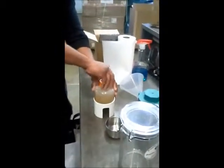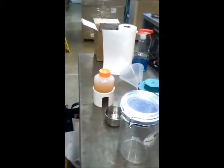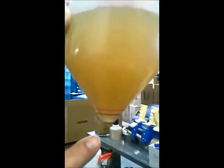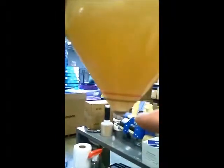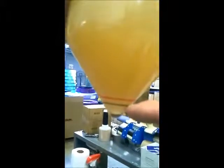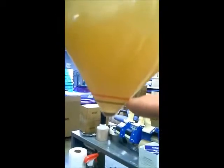Going to wait five minutes to examine what has settled in the settling container. What we're determining here, by looking at the first order of settling, is that the level of sand and grit is down here as opposed to above the black line. The black line indicates 2% fines; the red line is 5%. To be system sand, the fines need to be lower than 2%. And as you can see, our sample passes handily.